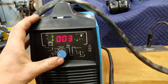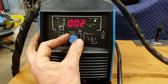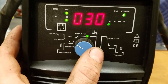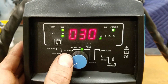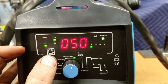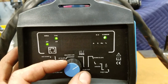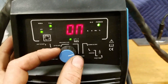This setting changes everything. I do not know how to get to a pulse, and I'm not sure if it's just marketing. You've got start current, up slope, welding current - that should be normal. It doesn't go to a base current like you'd expect for a true pulse function. Going back and adjusting... wait, I just found the off function - that's what that does. Now it's on.